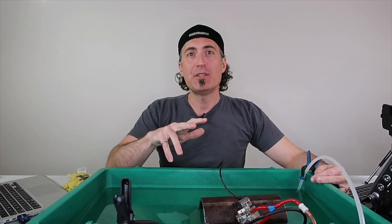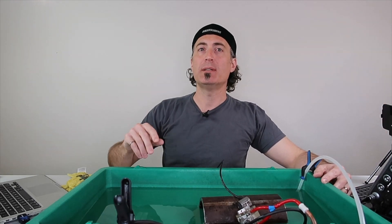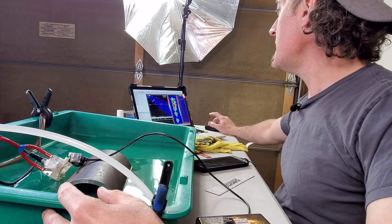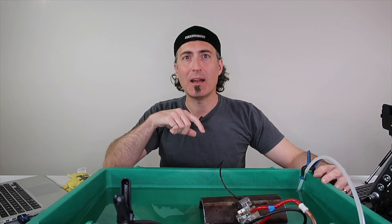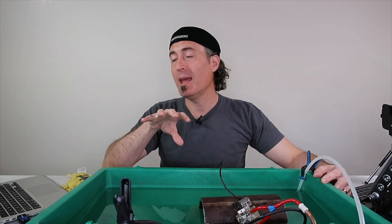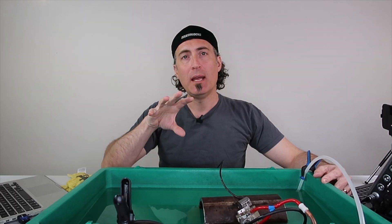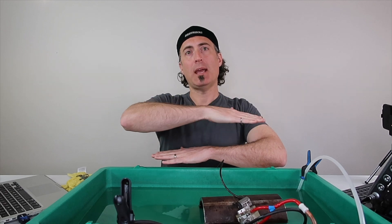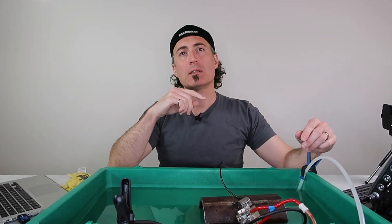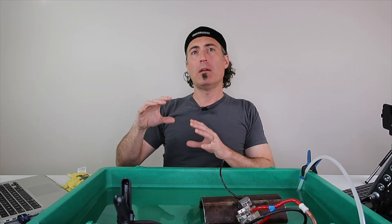Now that we've finished with the acquisition, we can take the data off of the Veo, put it into UT Studio, and take a look. The first thing to point out is that I'm going to use an extraction cursor — the orange box in the upper left hand side that's boxing in the indication I'm interested in. In this case I'm going to look at the ID corner trap of the through wall holes, so we're at the end of the first leg.